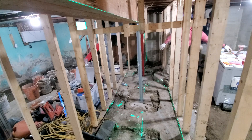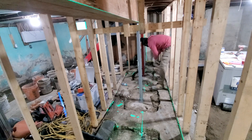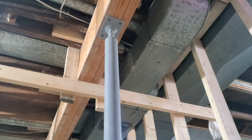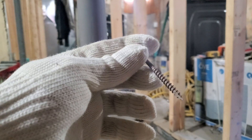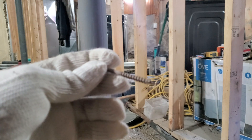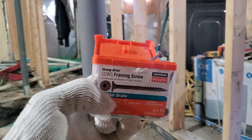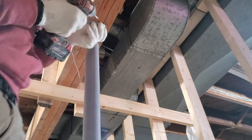So what I'm gonna do now is just take the measurement — it's one inch. Now we're gonna install our screw. This is a grabber screw that I'm using, designed for this application for LVL. This is a very strong screw that we're gonna drive into our LVL, and as you see I put a washer over it as well. Now I'm just gonna screw this in place.